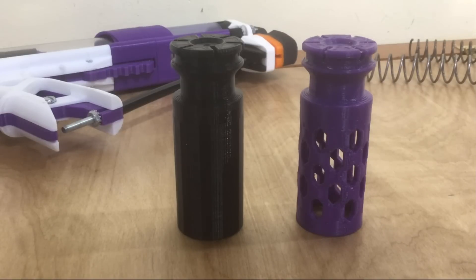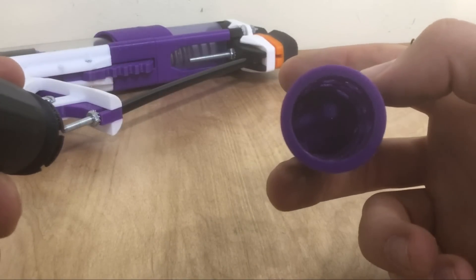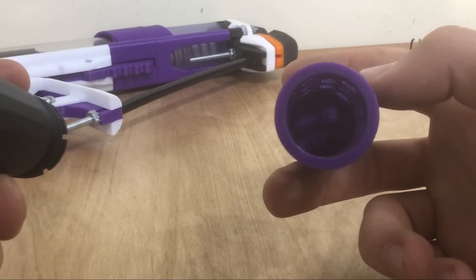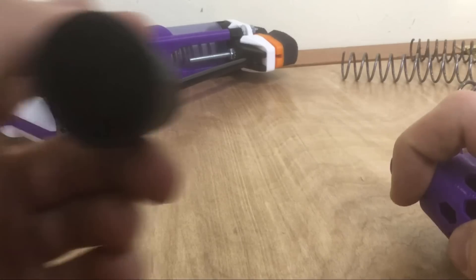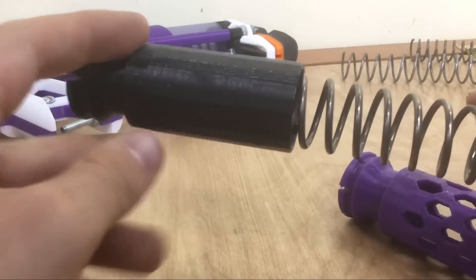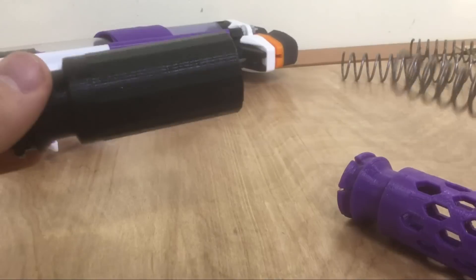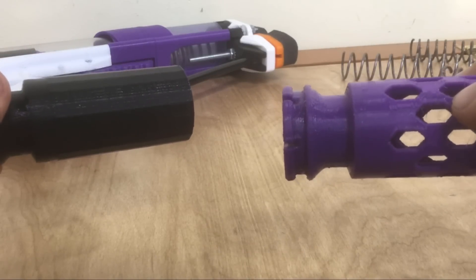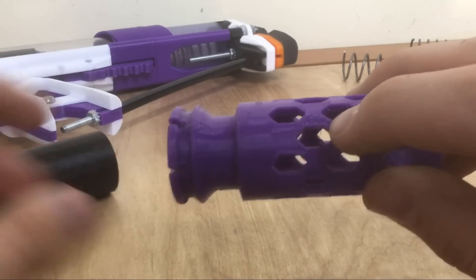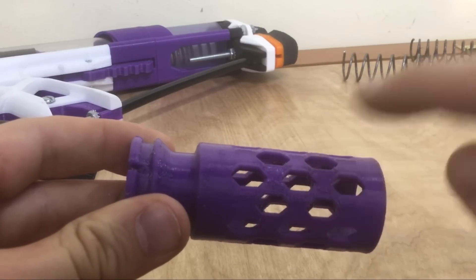The plunger is where a lot of innovative changes were made. This one's solid-walled, this one's not. The stock one has thick walls because there's plenty of space for the spring. To fit the K14, the walls need to be very thin, and that means we have significant structural problems — especially if we leave the holes in. My stock original ones with the holes in broke here often, just at those lengths they would break.